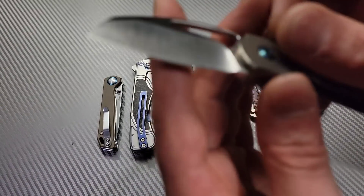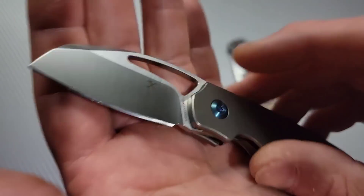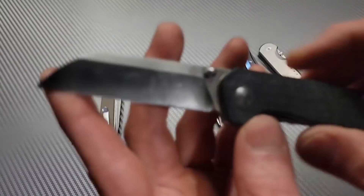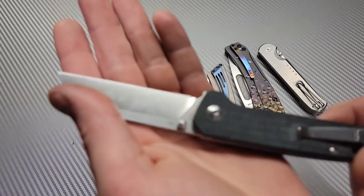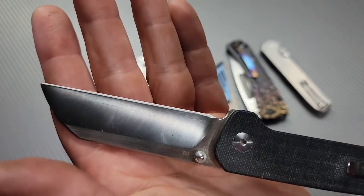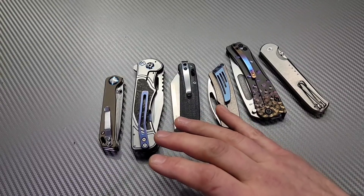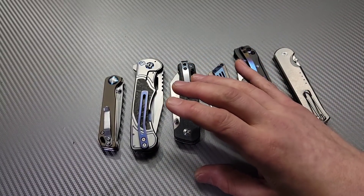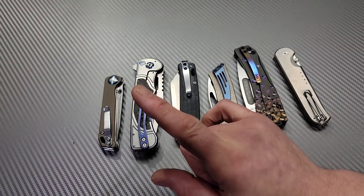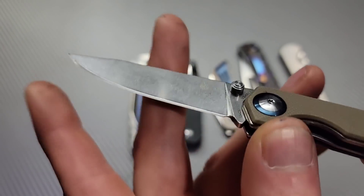This one I had to put in my own sharpening choil — it didn't even come with one. Should I have to? This one's had a lot of steel removed from it, and you can see how it's hitting the plunge grind, creating a smile. It's a knife, it's a tool, it should be used — steel is going to be removed. Factory edges usually come burnt, so we're going to have to sharpen it regardless. I don't like it when I can only sharpen it one time before it starts hitting the plunge grind. This one's had a couple edges put on it and now I'm at the plunge grind. You can see my stone already hit it.